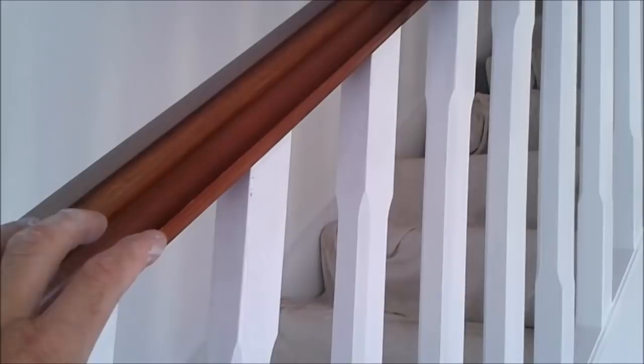Ideally when you're painting these, depending on how quickly it's drying, do three or four spindles on three sides, then go around the other side and bring in the back edge from that side. Then do another three or four and come back around to finish off the face. Just keep alternating going down.